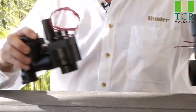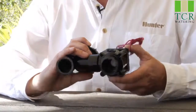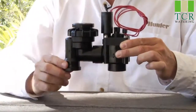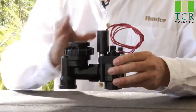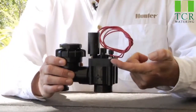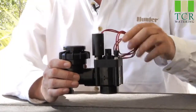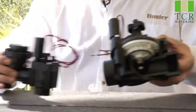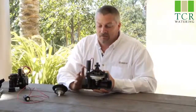You might also have something called the anti-siphon valve. This is not an inline valve that goes in a valve box — it mounts above ground, usually about 16 inches off the grade. This happens to be a slip-joint style, but it works off the same premise. The front half is the anti-siphon portion, and the back half has the body, the diaphragm in between, the same flow control, and the same solenoid and manual bleeder screw. This is held down by four screws, and the larger ICV inline is held down by six screws. So that's the basic premise of how valves work.